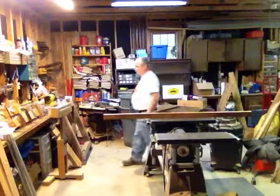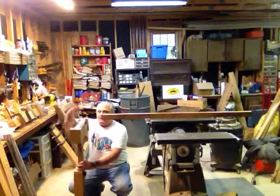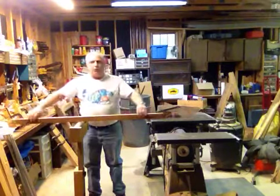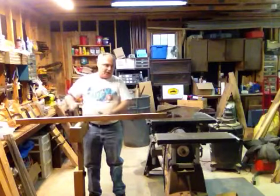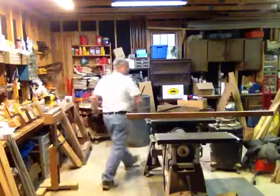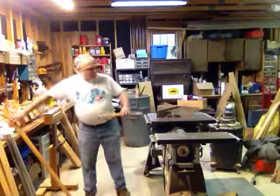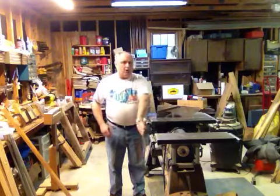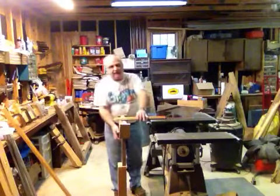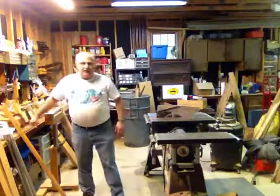There's more than one way around that. You can bring in a roller stand, set it up — it looks a little high so bring it down just a hair — and for long stock you can feed it through and it'll roll right off and support your piece. But if you're running relatively short pieces, they're still going to fall over. I could put a roller stand close, but I think that's rather dangerous. I like it further away. What the Shopsmith really needs is an outfeed table.